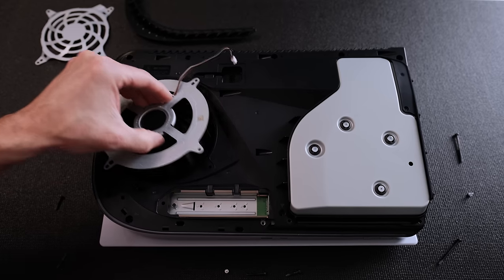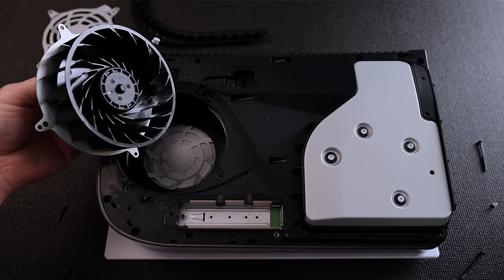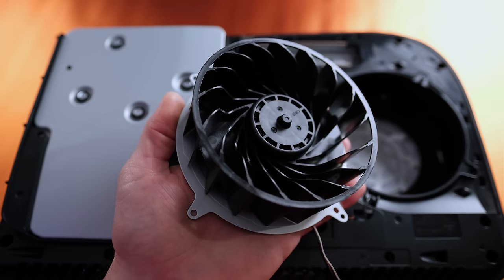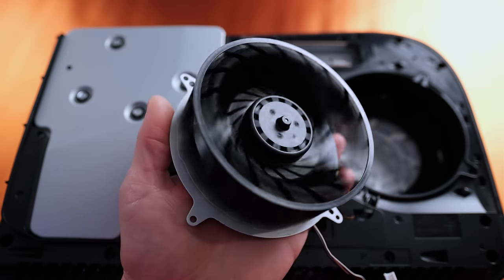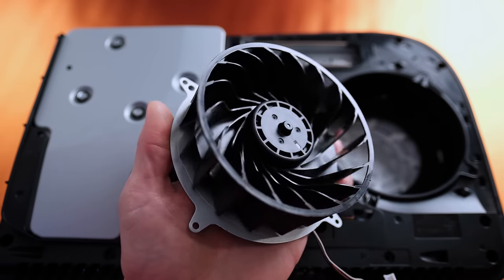The biggest complaint that I have about the design of the PS5 is the fan. It's huge, and it's the reason that the PS5 won't get smaller. Ever wonder why it's so big? Sony prioritizes fan noise over system thermals. The larger the fan, the quieter it is at lower speeds while still providing the airflow needed. The PS5 fan is restricted to about 30% of its full potential, and the speed is determined by the system wattage. One speed for idle and one speed for load.